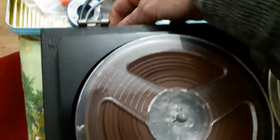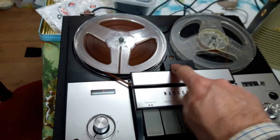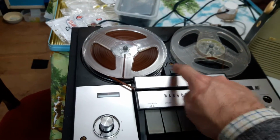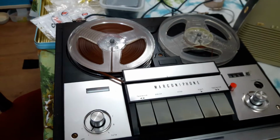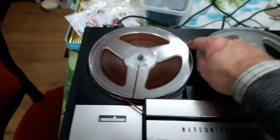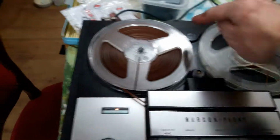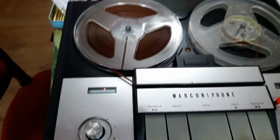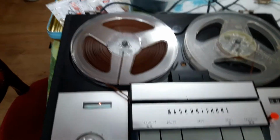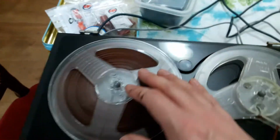I've got two others of these machines. This really being the most basic one, but it's in the sort of fancier cabinet. I've got two 4-track ones. You can see here there's a blanking plate where the 4-track would have the two buttons for each of the tracks on the first side, and the other two are also I've got a fast and slow speed, whereas this is a fixed 3 3/4 inches per second. The other two are 1 7/8 and 3 3/4 inches per second. Only takes these 5.5 inch spools. Won't take a 7-inch spool.